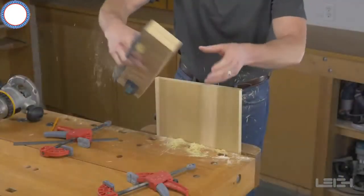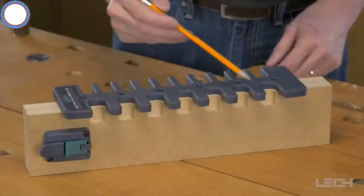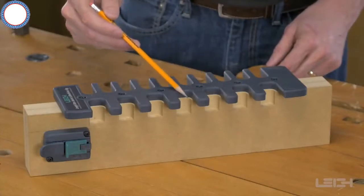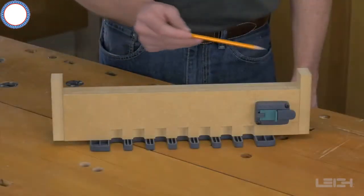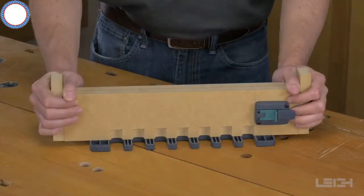Routing is then done straight in and out of each template opening through the board and into the beam. The other end of the board is used to route the grooves in the half inch side of the beam. You now have a groove routed in each template opening, and the beam and jig are ready to use. For use on a router table, handles must be added for safe operation.